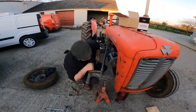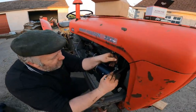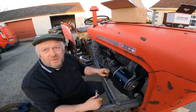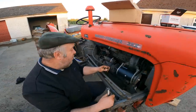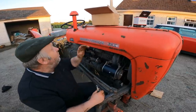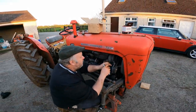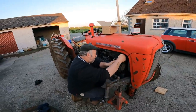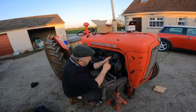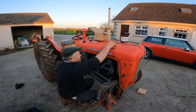Father Phil has been a busy man while we were waiting for the loctite to set. He's off to put a new dynamo on - it's not charging. He put a new harness on it a couple of months ago and it still wasn't charging. We may have to change the regulator box, but the old dynamo was well past its sell-by date. So it's a new Agriline dynamo - hopefully now she'll be charging.